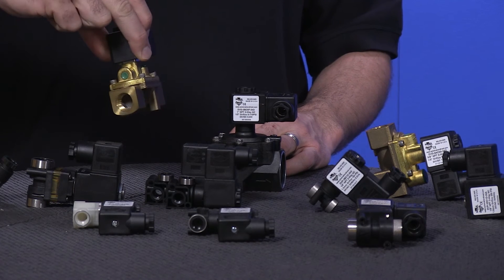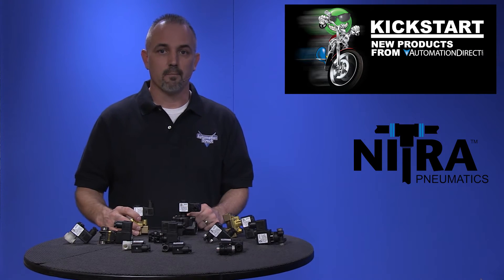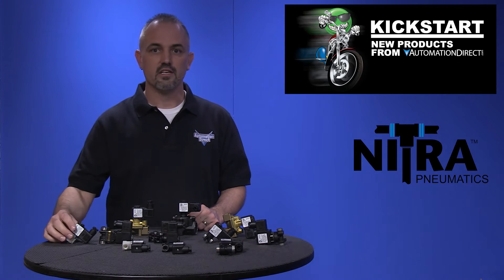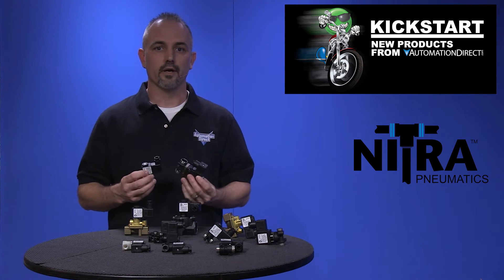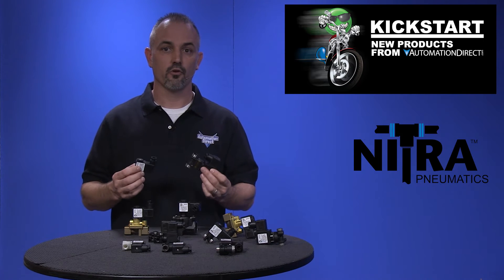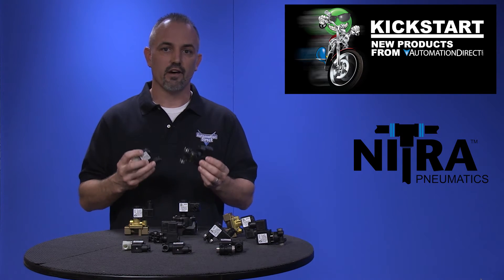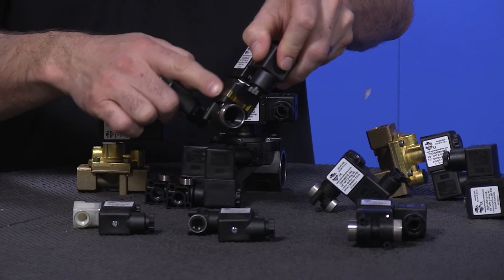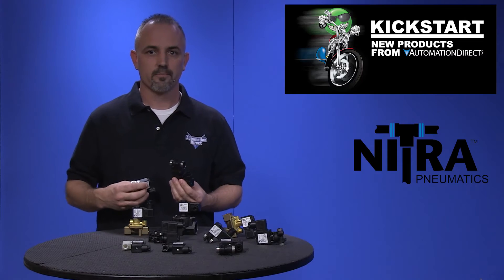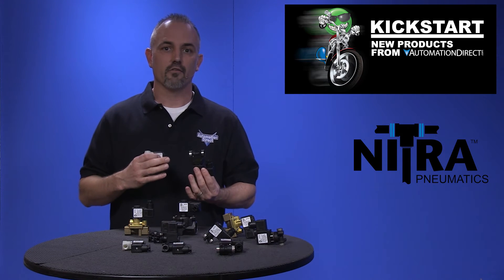The DVD series are two way two position valves with spring return. The Solenoid media separated process valves are the DVM series valves and are media separated, dry operator, two way, two position solenoid operated valves for use with gases or fluids where the metal working components of the valves do not come in contact with the working fluid. There are three orifice sizes offered. Body construction is glass filled nylon with Viton seals making the valves compatible with air, gas, water and chemicals.